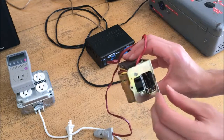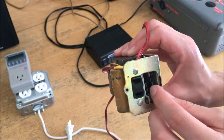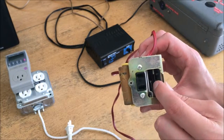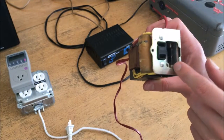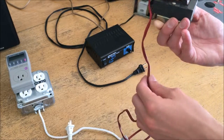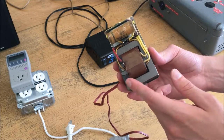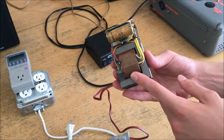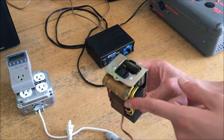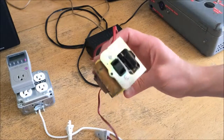And the interesting thing about this is it's fully mechanical. Now, it's hard to see on the camera, but if you look closely, this is a little tab connected to an electromagnet that goes back and forth when it's powered. And this is essentially a multivibrator that creates an AC signal out of the 12 volts going in. That AC signal is sent to a step-up transformer that bumps it up to roughly 120 volts, which is sent to a really crusty-looking 1 microfarad capacitor and out the plug. And unbelievably, it does actually work.